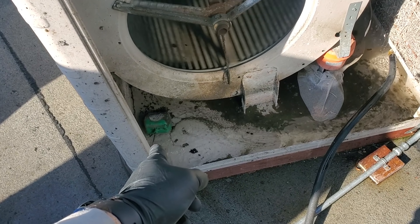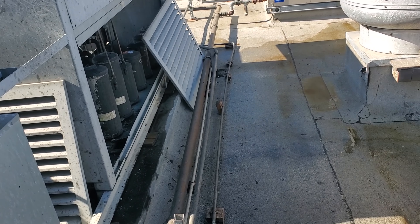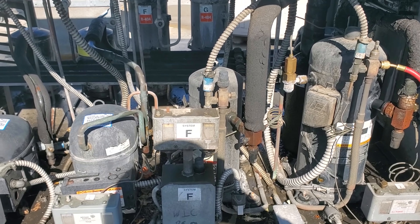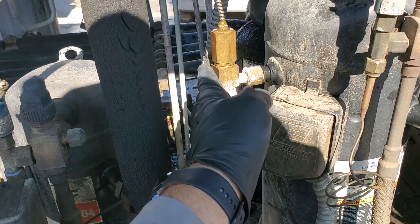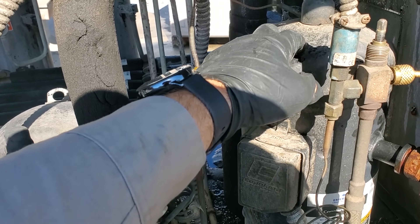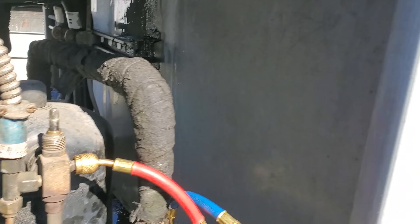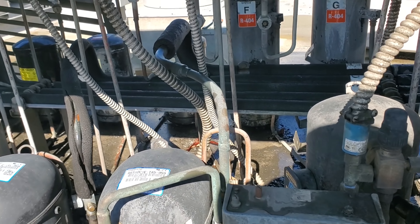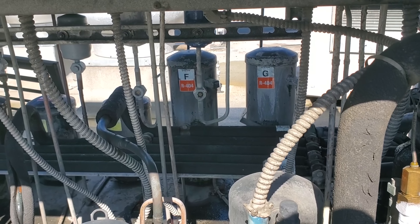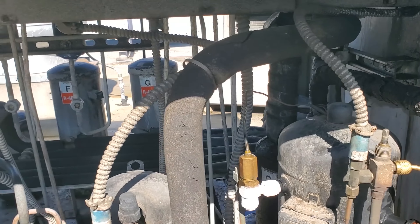The water flow was turned off — it was stuck, probably winterized. This has probably never been started up, so we have no water helping with the pre-cooling, which would explain a lot. Now that I'm filling it up with water you can see it's already flowing through it. We're lucky it didn't burn out the pump. It's going to take a very long time now that it's running. The DTC valve is working — this is the cooling valve that basically takes liquid refrigerant and meters it into the compressor when it goes into high compression ratio situations to help cool off the head. We've got a clear sight glass. It's definitely going to take a while to come down to temperature because that box was at 35 degrees and it's been there all weekend, so we're just going to let it run for a bit. Been about 25-30 minutes running — box is coming down in temps, sight glass is still clear. Refrigerant pressures are a lot better considering we're running with a clean condenser now and the evaporative cooler is running.